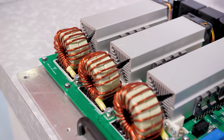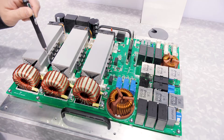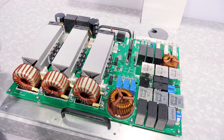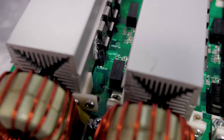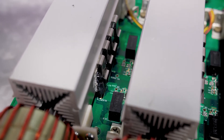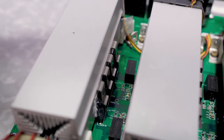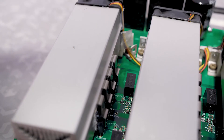Why don't we take a good look at some of the components on this? Sounds good. Our silicon carbide MOSFETs are soldered vertically onto the board. These are TO247 packages. To accommodate the heat sinking, what we've done is put the fans next to them and clip them on, particularly onto our devices with special paste in the back to transfer the heat to the heat sinker.